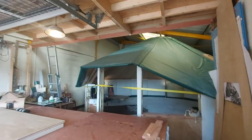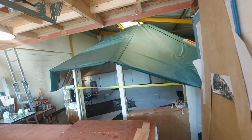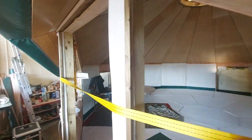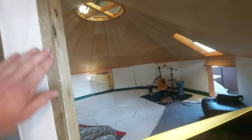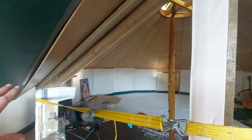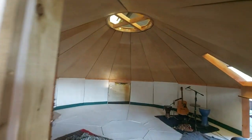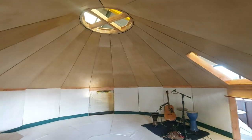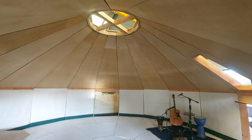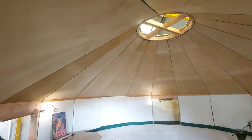This is my unit where I'm building the thing — this is the best view you can get of the yurt from the inside. I only put this band on last night just to continue it around until I get the door frames and window frames installed; once they're in, they'll take all that stress quite happily. So: one 20-foot wide internal diameter, then six-inch walls, then roughly a foot of eaves — so you could say it's actually going to be about 23 foot wide on the outside.